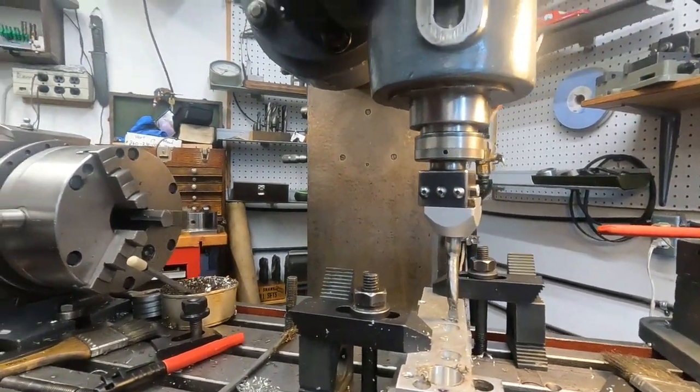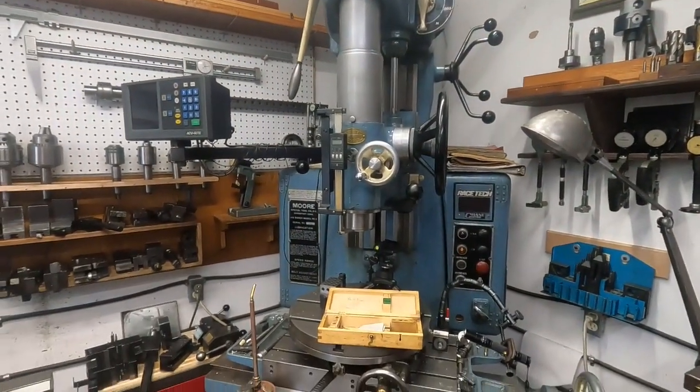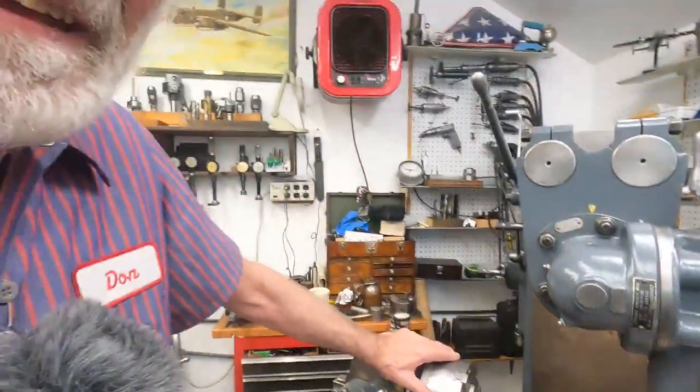there are other ways of going about this, and one is taking deeper cuts and forgetting the method that you need to do with the jig borer and just approach it with heavier cuts that kind of take a load on that rougher spindle, and I'll play around with that as I go. But I did everything that I did on that machine, and on that machine I got plus or minus 1/10,000th of an inch, and on this 80-year-old machine doing the same method, I got it plus or minus 1/1000th of an inch. But I think goofing around with it a little bit and taking deeper cuts than those real shallow ones you can take with the ball bearing spindles, I can get it to about a 0.5 thousandths.